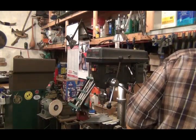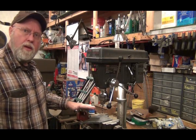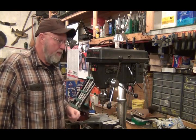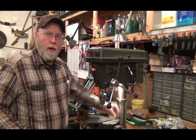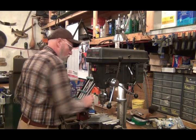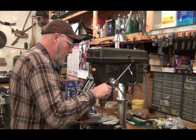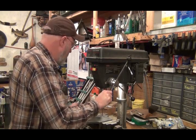This is not something that has to be machined down to the thousandth — accuracy isn't critical here. I've got my vise reasonably level, I've got some big parallels in here to support my plate, I've got my dead blow hammer, and I've tapped it down to make sure both my parallels are good and tight. I've got a quarter-inch drill bit in and I'm going to drill my quarter-inch hole. I'll just ease into it — like I said, this isn't down to the thousandths on the accuracy.